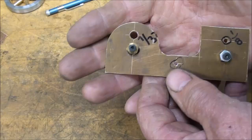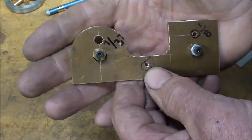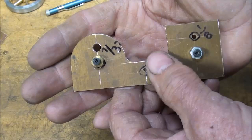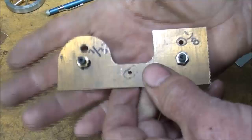But it was a big job to convert it over from bandsawing to band filing. Also, if you've ever used a little Keller type of reciprocating filing machine, sometimes called a die filer, that might be an application, but I do not like those. They're finger pinchers, they're only cutting half the time, and I just don't care about them. I did have one for a while and I got rid of it.